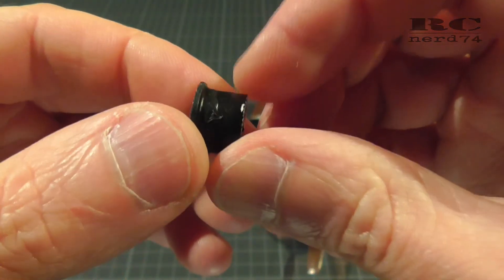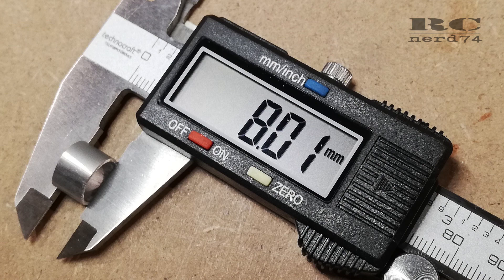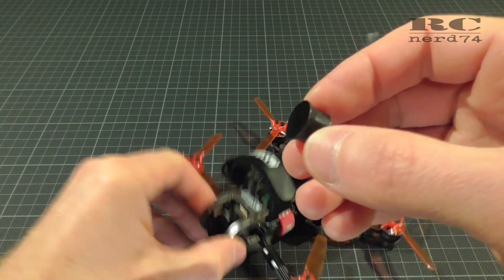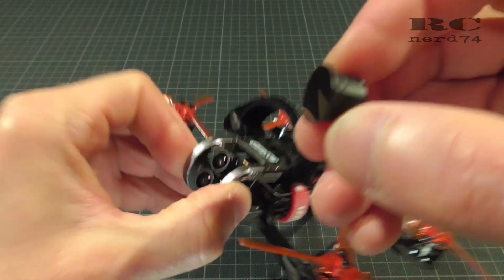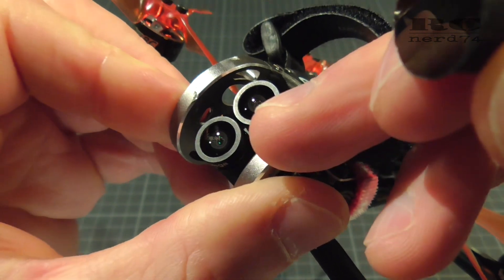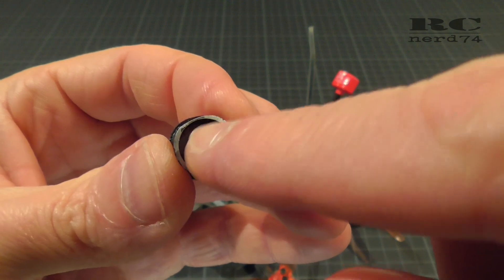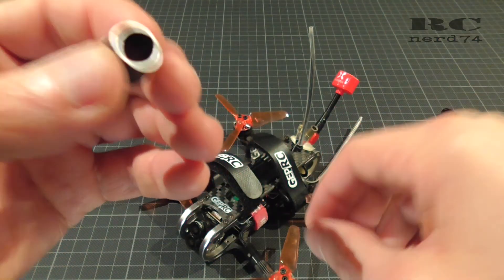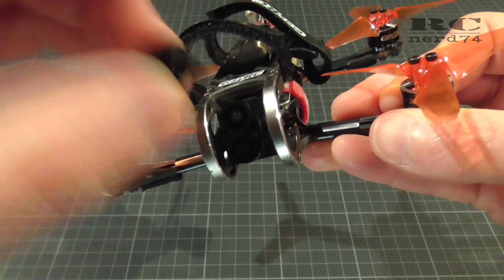The first step is to cut down your aluminum tube to the right length — it's about 8 millimeters. It's important that you leave some space between your lens and the glass of the filter so the filter doesn't touch the lens and you don't get any scratches on your filter glass or camera lens. Then there is a little challenge because you have such a tiny gap between the two lenses — just a few tenths of a millimeter — so you have to sand down the lower part of your tube to about two tenths of a millimeter. Sand it down just enough that it fits between the lenses so it sits better and keeps the filter in position in case of crashes.